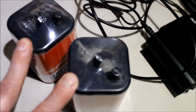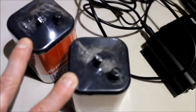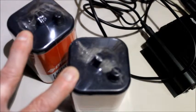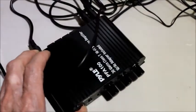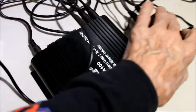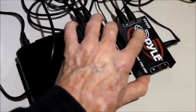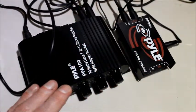Then these two 6-volt batteries — I'll hack the cords to those adapters, make sure I get the polarity right, connect these two 6-volt batteries in series, and power up these amplifiers. This has speaker output, so I can connect a small speaker without internal amplification to that.